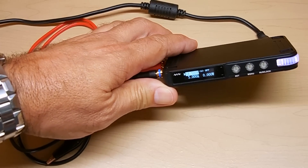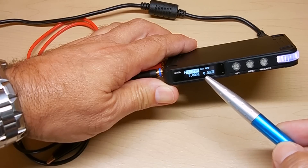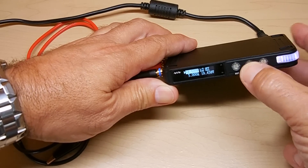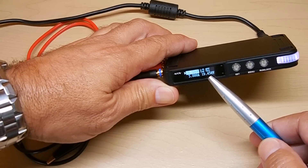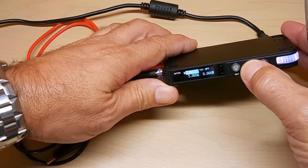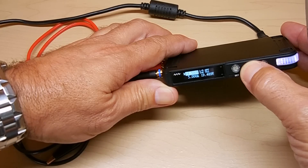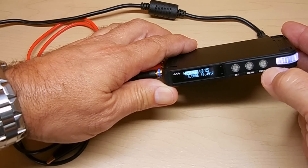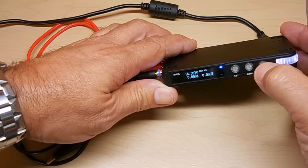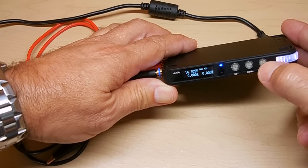And you can see it's set right over here — 14.5 volts, 5 amps, and zero watts. It says off. If you push the menu button, it says input voltage 19.45 — that's coming from my printer cable. You get 19.489 from the printer and it's off. If you want to turn it on, you push the run lock button — now it's active. Push it again and the blue means you're ready to go. If you see this turn red, that means you're having a problem with your output — you're drawing way too much power or too much current.